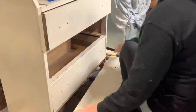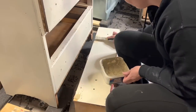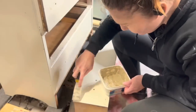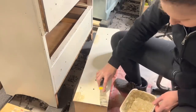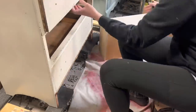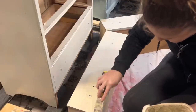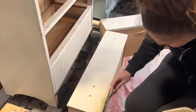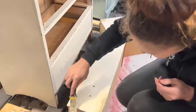I had to do several rounds of these drawer repairs. As I was filling with wood filler on the missing pieces of veneer, I found more pieces that were lifted. So I had to go back again with more glue in the syringe, fill those, then get those taped and clamped back down. I just let everything sit overnight. That's kind of how I do it when there's just a ton of little tiny repairs — they're just tedious. I'll do as much as I can, let it go overnight, and then start essentially round two of the same thing. I'm not using anything crazy here — this is just Elmer's wood filler. These drawers are going to get painted black, so it just needs to be smooth.